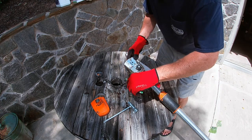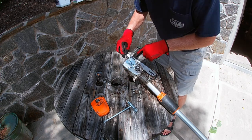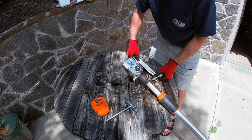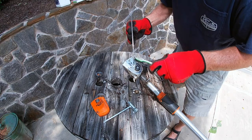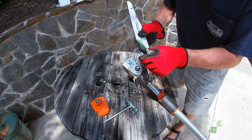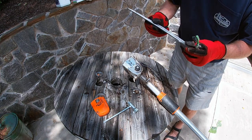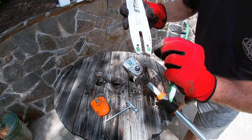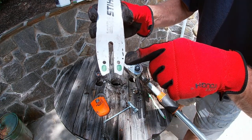It's a really good idea especially when you are servicing or changing your chain to go ahead and do a nice service and clean. The main thing you want to make sure is that the holes that feed the chain lubrication oil - right here - are nice and clean. You want to make sure they're clean here as well because if the chainsaw can't get the lubrication oil to the chain, it will burn it up in a heartbeat. Right here is a little hole on the chainsaw bar where the oil comes in and this is how the system feeds it.